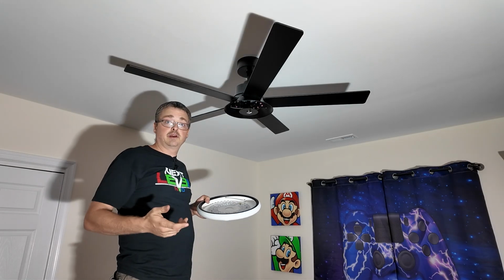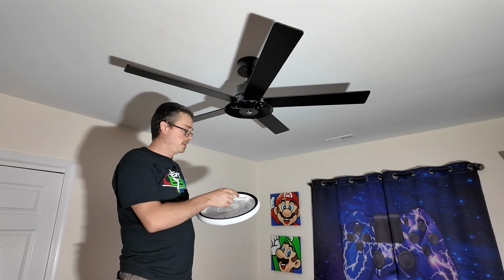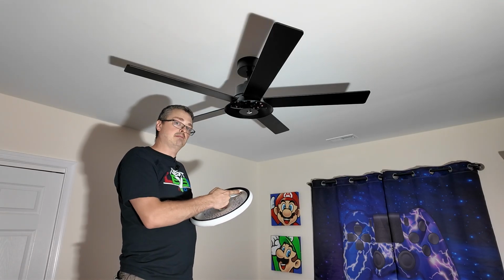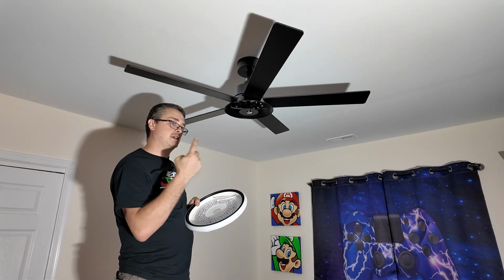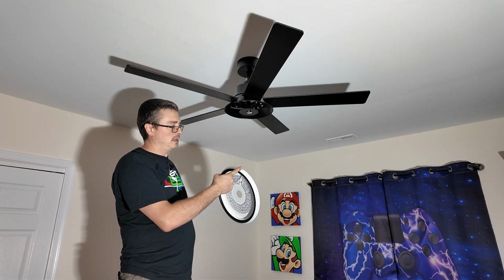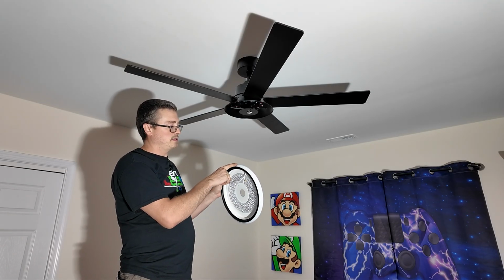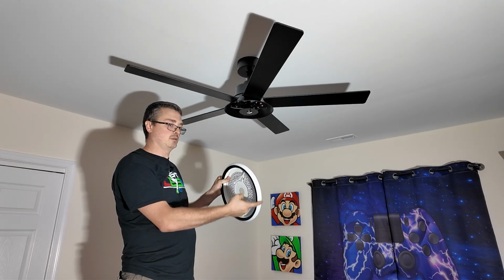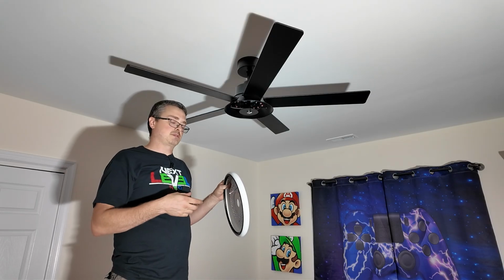Now here's something I did figure out upstairs. The input for this ring, it's basically just a big strip. So the strip starts where this wire goes in. So if you keep that in mind, the ring can do the animation in a circle. Well, if you're looking at it from here, it might look a little chunky, like it'll come around, and then when it goes here, it doesn't just keep flowing, it sort of just stops, and then the new flow starts. So it looks a little bit weird. If you know addressable, you'll understand what I'm talking about.